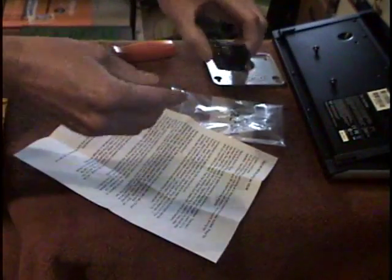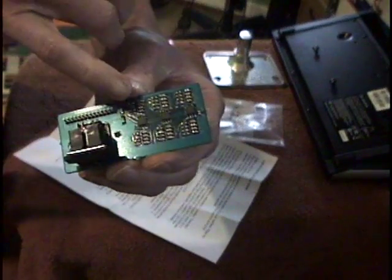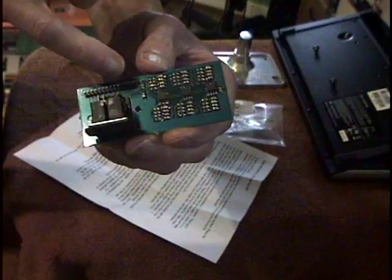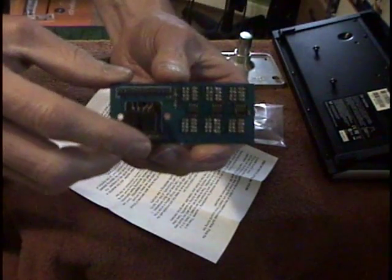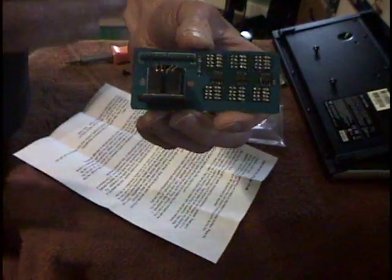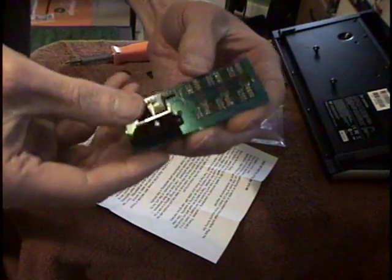Here's the jack board itself. You can see it looks like we have three integrated circuits — I'm going to guess they're all dual op amps, and that's exactly what they look like. We've got some capacitors and resistors, so they look like they're probably a Butterworth high-pass filter, meaning they're going to pass frequencies above a certain point and filter out the lower frequencies.